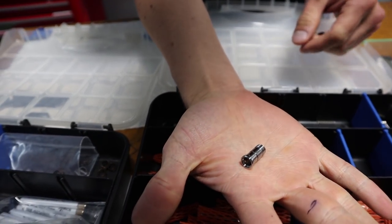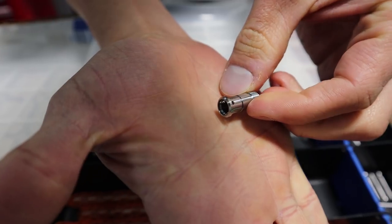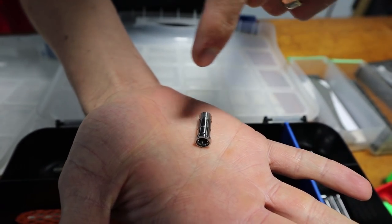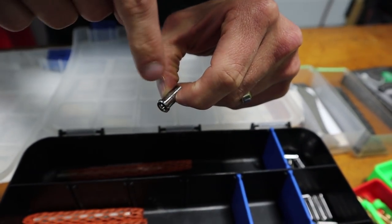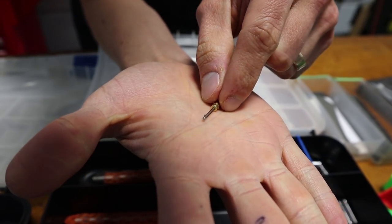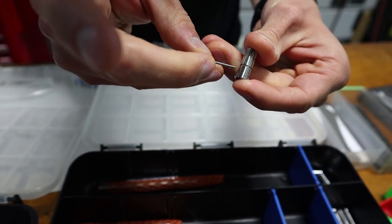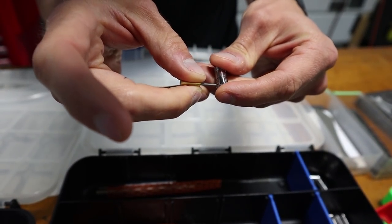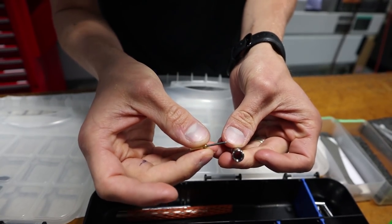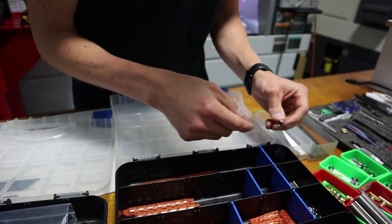Here we have the threaded sleeve with the three ball bearing holes. I noticed when making these three holes I didn't want to use a drill bit to just drill through, because drilling on a round with a tiny little carbide drill bit makes me worry about the drill walking off-center. So I interpolated the hole with a small end mill, but it left a little burr on top and bottom. I got this Cogsdill back-chamfer tool — a hole chamfer tool — and right now I'm doing it with that in a drill by hand. It chamfers the top of the hole and the inside of the hole on the way out. Eventually we'll put that on the lathe and do it automatically in-process.